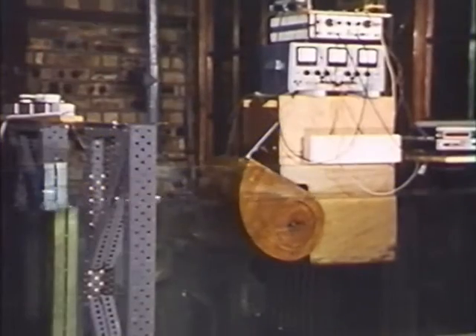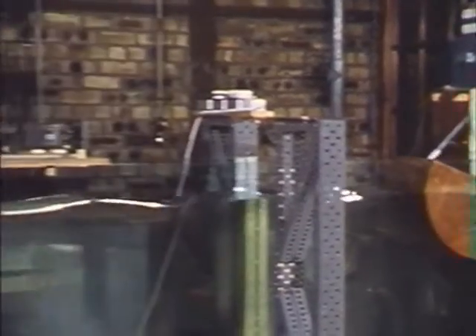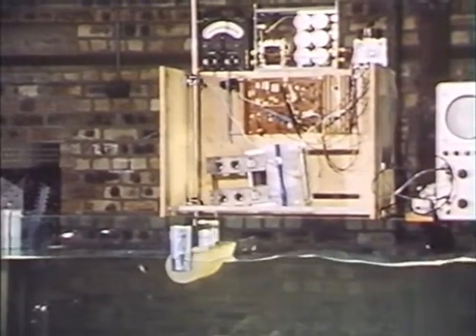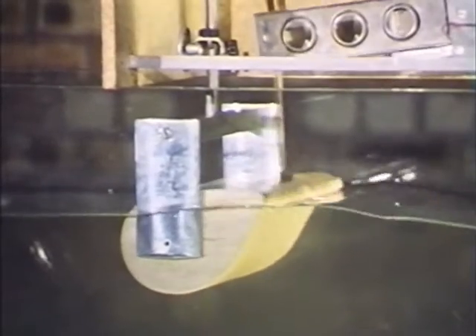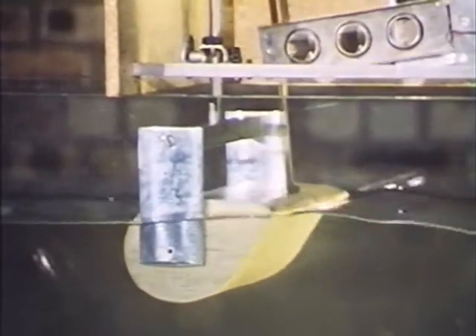We start off with the very first wave makers, which were rather duck-like. There's one making some rather short waves, running long past a single wave probe, to the first balsa wood duck with an external dynamometer — a couple of magnets and a couple of coils like big galvanometers — supported on a fixed mounting, connected to the dynamometer by that little push rod and an elastic band. We were able to get to 90% efficiency with this first duck.